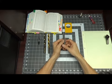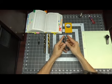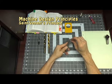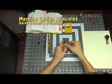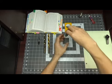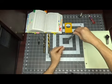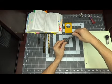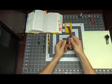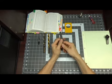Taps also come in a bunch of different shapes and sizes. The one thing that you're going to get a flavor for in taps is that they're tapered. About 2 critical dimensions, and that's using St. Venant's principles of characteristic dimensions, the taps are tapered. And that's because when you do your drill hole or your clearance hole, you're going down, and as you go down you want to make sure to center a little bit, and then these features will cut the threads into the base material. This is also a tool that wears out.